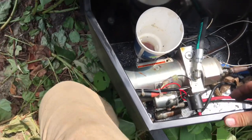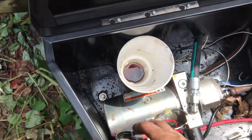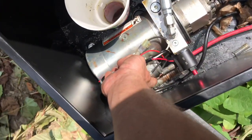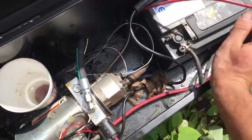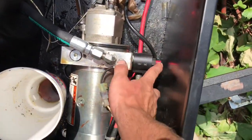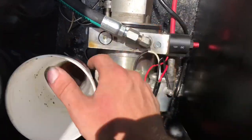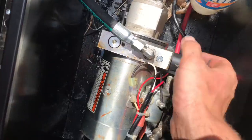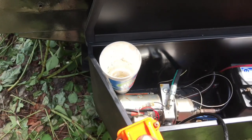The ground is grounded right to the trailer frame. I directly bolted this using a special tap drill bit — you drill and it taps, so I just screwed the bolts in with no nuts on the bottom, which makes it really easy. The positive goes to the solenoid on the bottom, which connects to the plug. The solenoid is a little electric actuator that opens the valve to let it go down. Every time I raise the dump, I have to push this in and turn it — it takes a long time to go back down, but it's really easy to go back up.